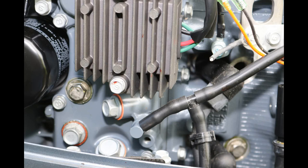It's easy to find and check your anodes down below the cavitation plate on outboard motors, but one of the things a lot of people miss is the anodes that are screwed into the engine block on your water jacket. That can corrode over the years and get you in trouble if you don't know about them and don't take a look at them.